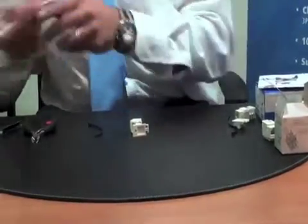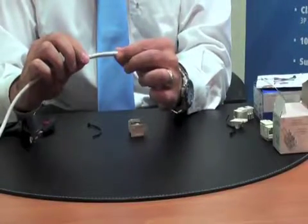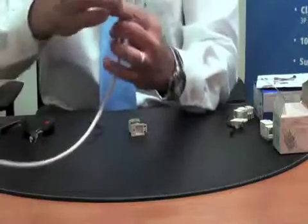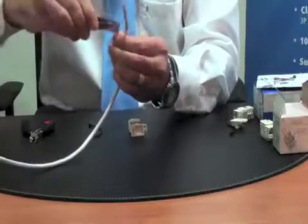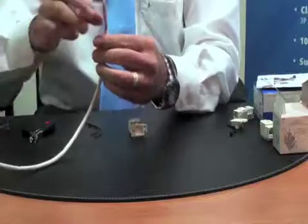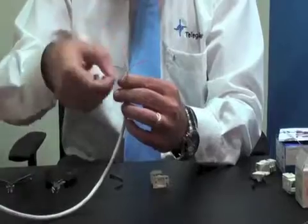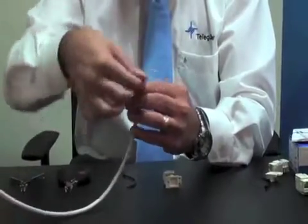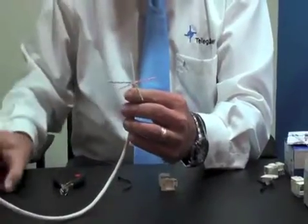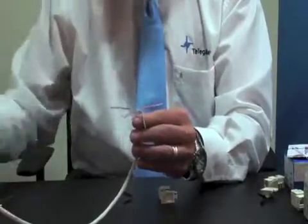What we do is take our cable and strip four millimeters of the cable from the jacket — very straightforward. We cut the extra Kevlar cable, fold the wires back, and remove the cross membrane from the cable itself, flush, then set aside.